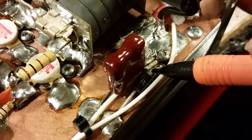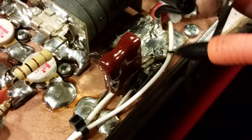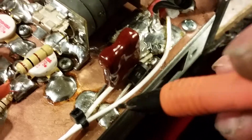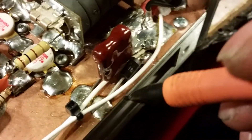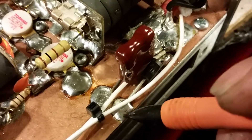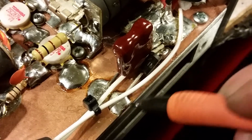It's just where that relay sits on a board, and then that board sits directly on top of the 10-amp relay and it fits on there perfectly. This diode here — the lead kind of went over to the middle. I just cut that and put it right there on that pad, to make that lead as short as possible. Just remember in the future: try to make your leads as short as possible.